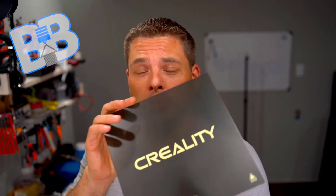I simply use a glass build plate that I purchased on Amazon. I purchased it a couple of years ago and that particular one isn't available anymore, but glass build surfaces are all over the place. There are multiple build surfaces you can use for ABS — glass is just one I use because I use it for everything. If you are using glass, I suggest you try getting some Magigoo. Magigoo is a magic adhesive you can put on your build surface to allow prints that tend to warp or pull up from the bed to actually stick. It takes a little bit, but this will last me years — well worth the investment.